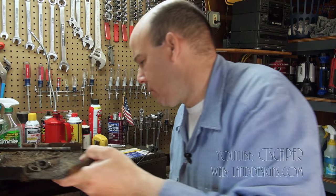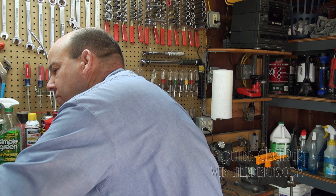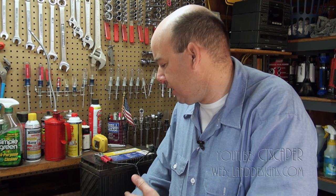And this one still works, but my thought is from here on out, every year, every year, 2 years, I'm not using the machine a ton, I'll power wash, pressure wash the machine. Part of my new thing now is I'm gonna go ahead and remove the battery and pressure wash everything around the battery and make sure that there's no rust. For whatever reason, the battery acid gets out, starts rotting things. And with both the Bobcat and the Dingo, I've just had some ridiculous amounts of rust on there.